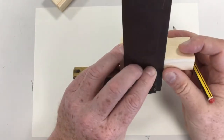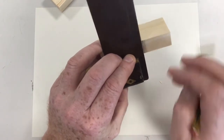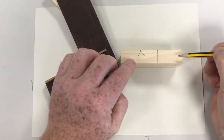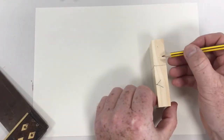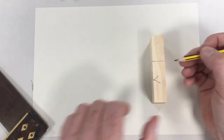And then turn the wood up and you're going to do exactly the same down the side. We're going to draw a line there. Nice wee light line, because our joint is going to be in here. Okay, the two holes, just like this. But what we need to find now is the centre. Now we know the wood's 20, so half of that is 10.